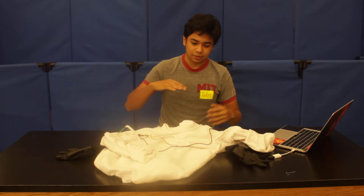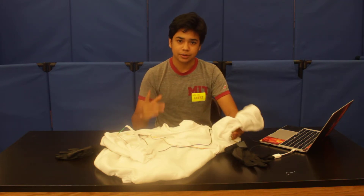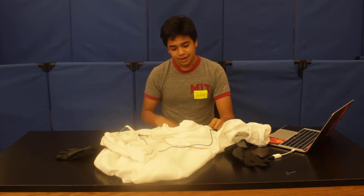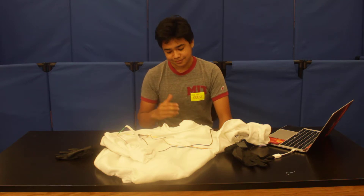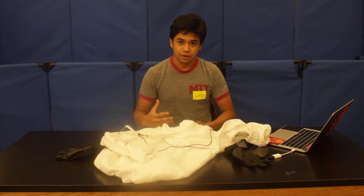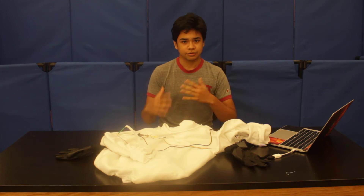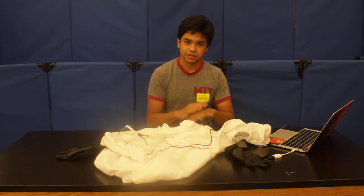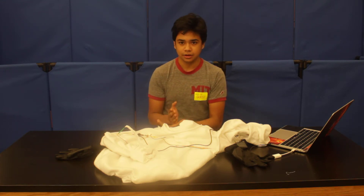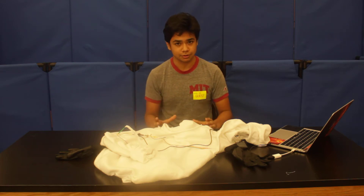What we discovered is that when we had both of them on, both of them would light up perfectly. And then when we had only one of them on, both of them would light up but on this very, very low glow. What I eventually figured was there's something wrong with the circuitry — something connecting the two wires to make them share voltage. So that when both of them are on, all the voltage is good, everybody has what they need. But when only one is on, they share the voltage — they split the voltage meant for one into two — and that causes both of them to be really, really, really dim.